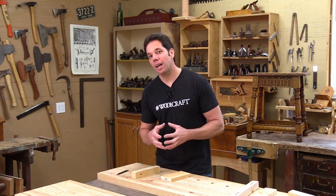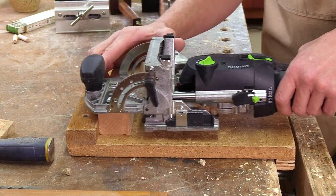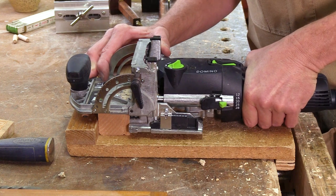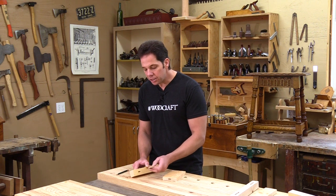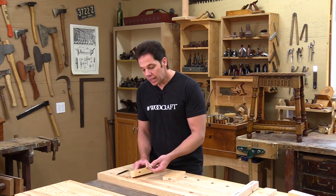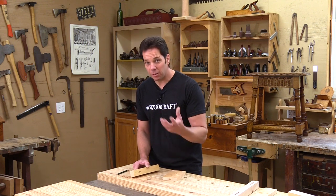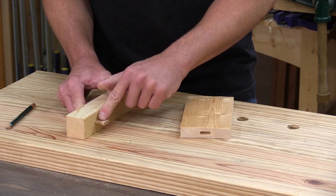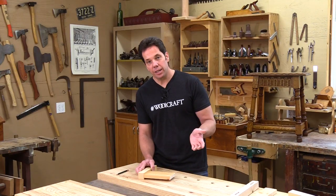The next example I want to show you is using the Festool Domino. This machine cuts an oval slot in each of the pieces, and then it comes with what they call the domino itself. Essentially this is like a dowel pin but with a wider surface area. It's also going to have less chance for wood movement to cause changes like we see with round dowel pins. With some glue inserted into both pieces, we've now formed a mortise and tenon joint.